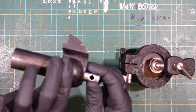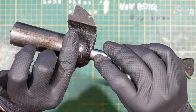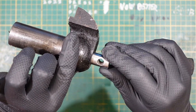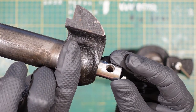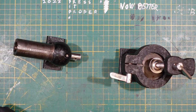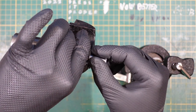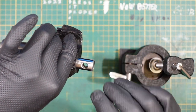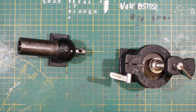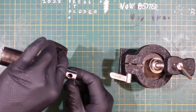So, progress update. Let's start with a thing that I did, I think, already 2 days ago, and just failed to mention it. As I was saying, this shaft, which actually moves the jaw, has a hole here that was rather nasty, with no deburring whatsoever. So I've addressed that. I used a Dremel and those tungsten something tips, basically for grinding. And I think it actually went pretty nice. It's really soft, and I also used some sanding paper, much higher grit, like 1000 or 500, just to make it nice. So yeah, that's done, no more attention needed here.